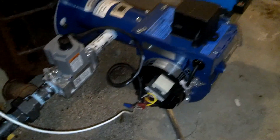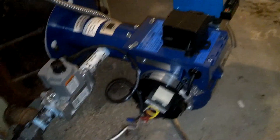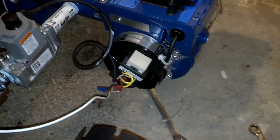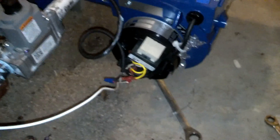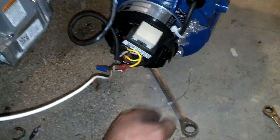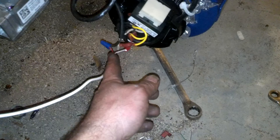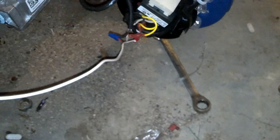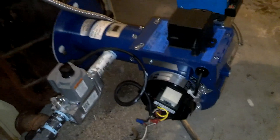So what I did is — on the Carlin burner, if you look in the manual, it'll tell you it's got a 24-volt transformer powering the gas valve. To find that 24 volts, this Carlin burner has this cap right here — you just unscrew and take off — and then there's the 24-volt transformer. So in this case I just tied that rollout switch right into the 24 volts, then over to the air switch, and then over to the gas burner. That's a quick easy way on how to wire that rollout switch.